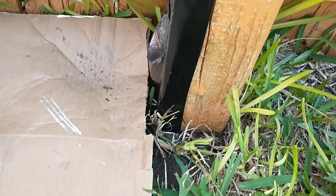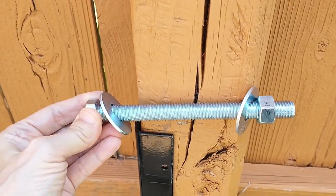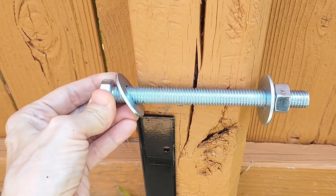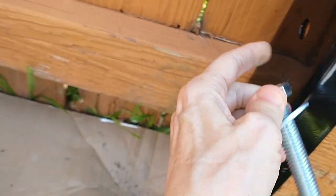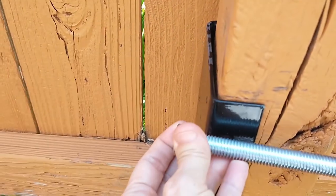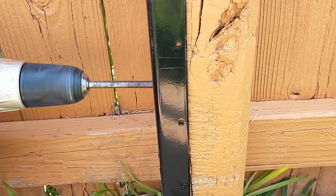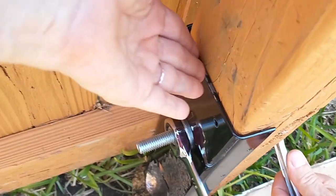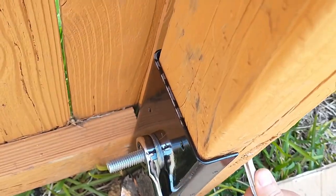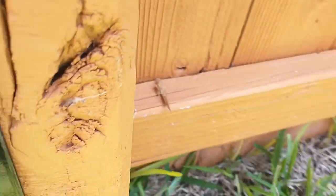We've hammered down as far as we can get it. We've also purchased a half-inch bolt — it has to be long enough to go through your beam. We're going to have a washer on each side and put it right through here. This will help anchor the metal to the wood. We're going to tighten the nut so that this brace is pulled very tight against the pole. The washer keeps the bolt from sliding through on that side.